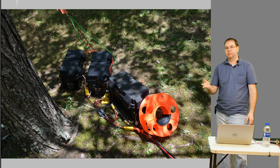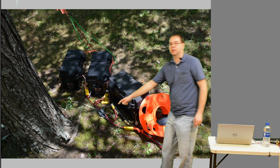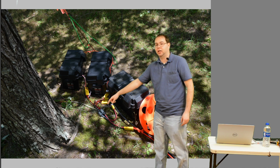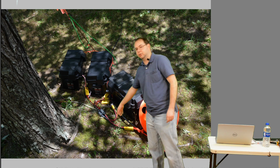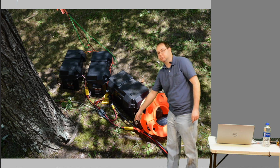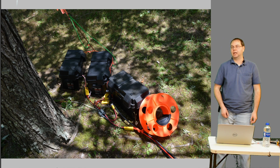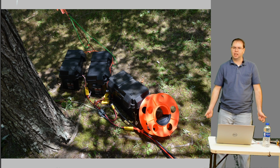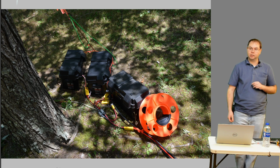So here's the picture of the batteries, a little closer up by that tree. You can sort of see in the picture on the ground the distribution blocks, and there's an extra pigtail laying on the ground, and the 3 that are hooked up. And over here where it's connecting into the cord going off the bottom is actually a set of heavy jumper cables that were cut up and had connectors put on. I think that's a 6-gauge cable, about 10, 12 feet, that runs into the tent, so that way I don't have too much voltage drop on my connections.